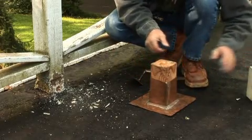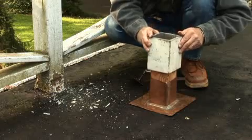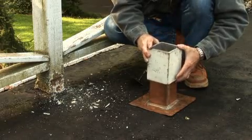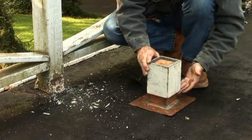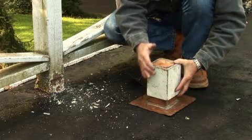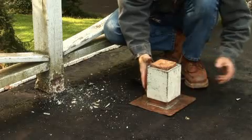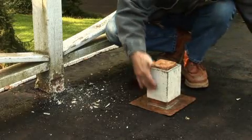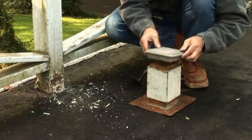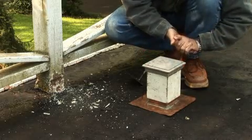The solution for this problem is to add a cover over that flashing, like that. So you install a 1x box around the post that goes over the flashing, and that's what you will get to cover, so the water cannot get behind that flashing, and then you put a cap on top, and that will be the completion of a post.